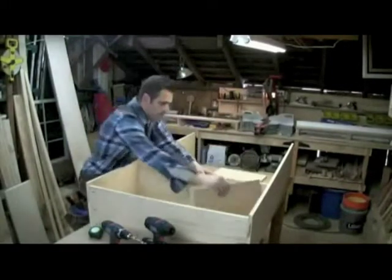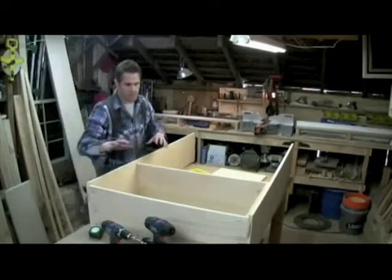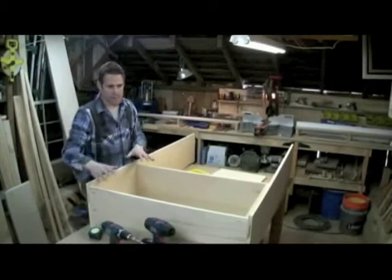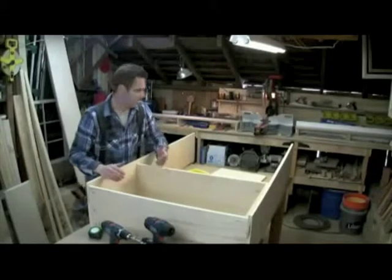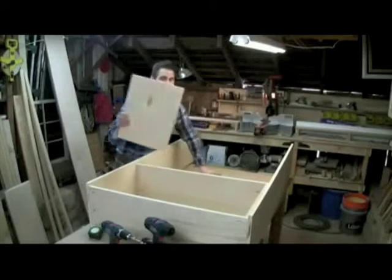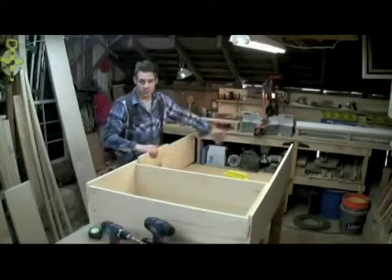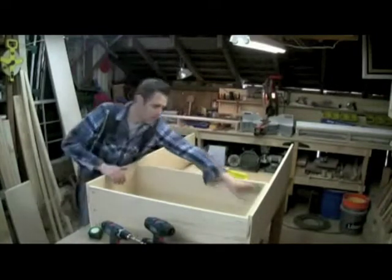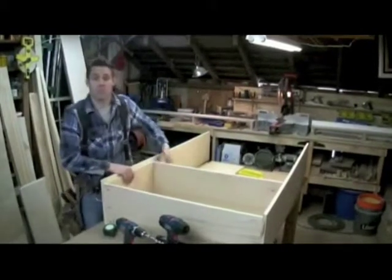I take this exact spacer, put it on that side and do the same thing. The way I built this one, these spacers could be a little bit off - I like the top one to be a little bit larger, but you can make that spacer whatever works for you. The lower ones are exactly the same. Once that's done, I put the spacer in there, I put the next shelf and the next shelf and the next shelf. That could be as tall as your bookcase goes. Very simple - I'm going to lock that into place and start screwing these in.